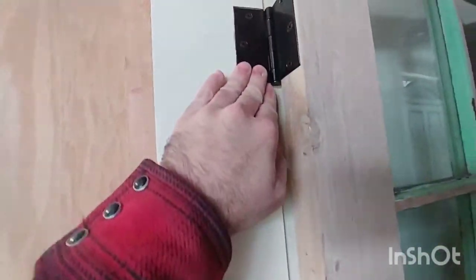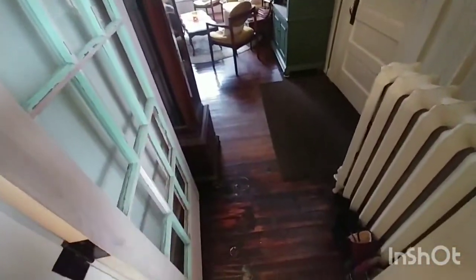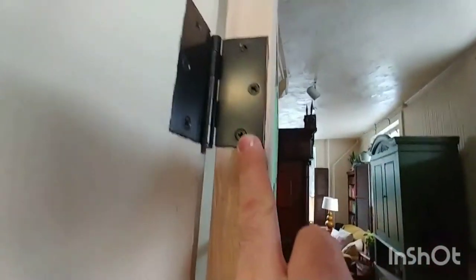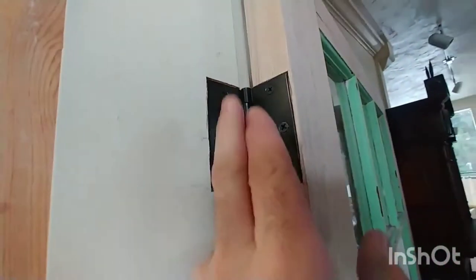Where were we before? Putting in the hinges, I established that I wanted to swing the door this way into this location. Every other place here, I had the freedom to swing either way if I'm going to mortise my own hinges. So I might have swung it right-handed, but I chose left-handed swing as far as this door's concerned. It made the most sense. You want to think about that, is my point. And then I quickly put in, as we looked at before, the mortise for the hinges on the door and cut and applied the hinge there.